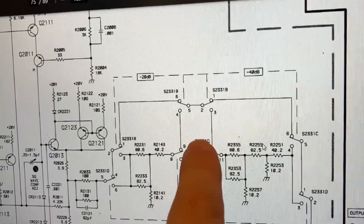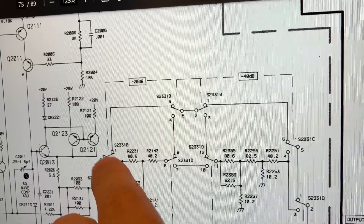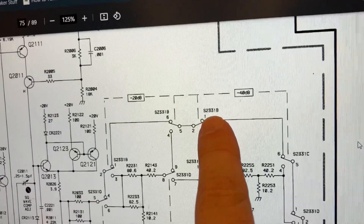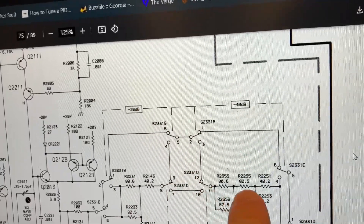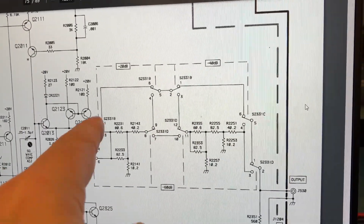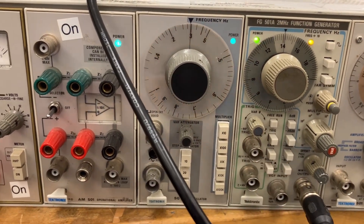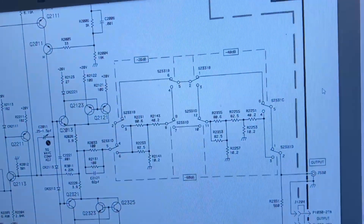Something else funky is going on with these other ones. I suspect this is the minus 20 dB switch, so that when these come down, this attenuation is in play. And then I think there's probably a typo here — you see there's 1, 2, 3, 4 — this B here. I bet this is supposed to be 2-3-3-1C, so the C would be the minus 40 dB switch, and these come down and that goes through this attenuation sequence. The 0 dB attenuation bypasses that whole ladder. I doubt this switch is actually hooked to anything — it should be designed to put these other switches in the default mode, but it's not doing that.